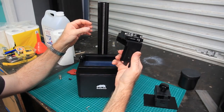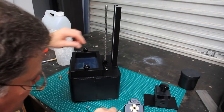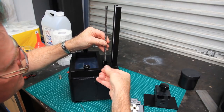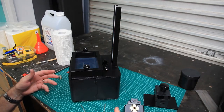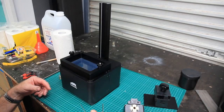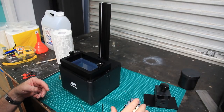And I know people have had issues with the rail not being even, and I've had this myself. I've actually bought some of this material for another job, and that's one of the things I discovered about it, was that the consistency of the distance between the rails isn't great, and all things considered, this type of rail isn't made for a really precision machine or whatever. It's a budget thing. When I bought some of this stuff, it was actually classified as lift door rail. So this is a linear rail for a lift door mechanism to operate in, you know, so that the doors slide backwards and forwards. And so not super precision.